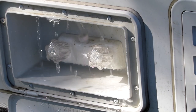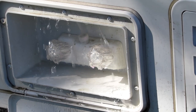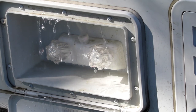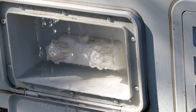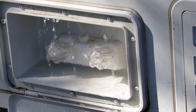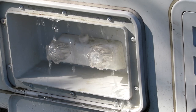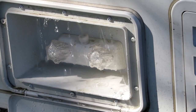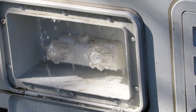And I know I'm going to get flack from people because I'm using a black garden hose. But that's not so bad as long as the water's running. The problem with using a black rubber hose is it'll give a bad taste to your water if it sits in the sun and the water sits in there. I use my regular garden hose to fill the tanks. I run it a long time, 5 or 6 minutes, before I actually use the water that's coming out of the hose. We'll be sanitizing the whole water system as soon as this all goes.